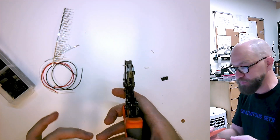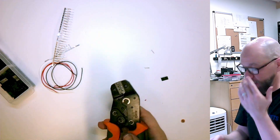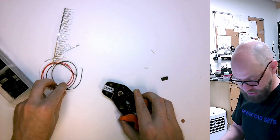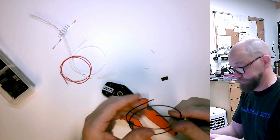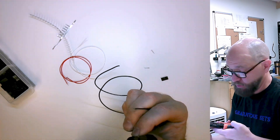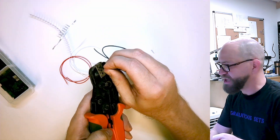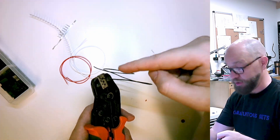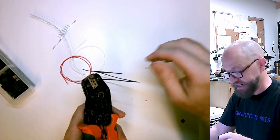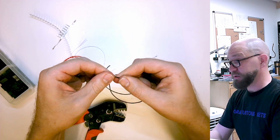These have a ratchet on them — on this particular brand, it's four clicks. I would have two pairs of these; they're the only ones I've used, so they're the only ones I can really talk to you about. Then we're going to take our wire that we just stripped and feed that in there. You can kind of push it in and you'll be able to feel where the insulation you didn't strip off is starting to engage and it's not going to go in any farther. And then pump it down — there he is. Let's do this three, four times.